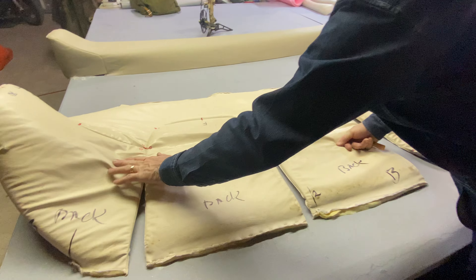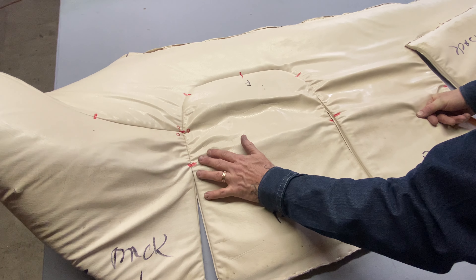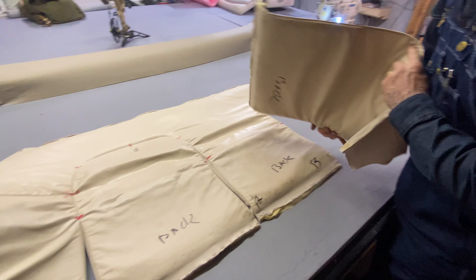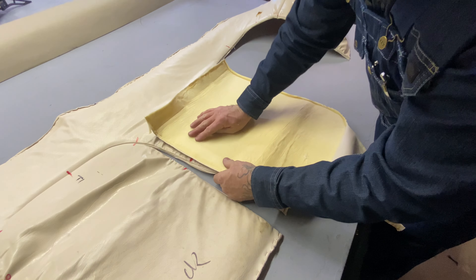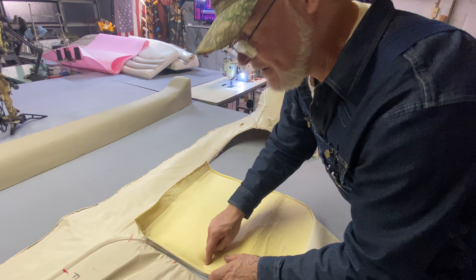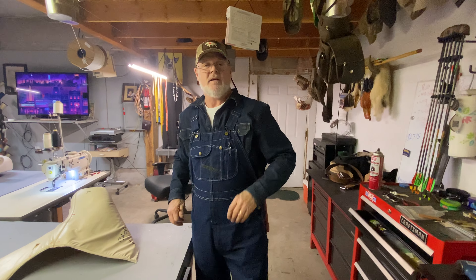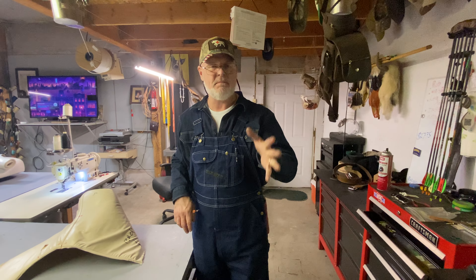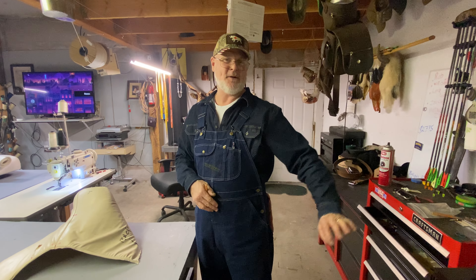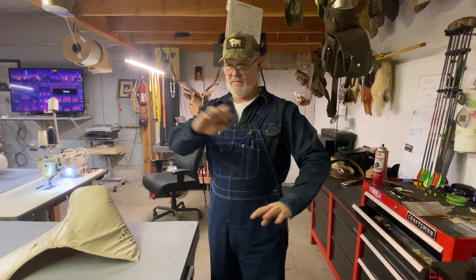You'll see the wrinkles in here — there was gathering here. He pulled it out when he upholstered it, but that shows he was trying too hard, pulling instead of letting the machine do it. He wasn't mindful that when you have two pieces of vinyl together with foam and you're sewing, there could be some gathering. Just go slow — about three inches at a time and stay true. Plant your needle, adjust, plant your needle, adjust. Be precise and consistent and always be mindful of gathering underneath you and what surfaces you're using. You don't want to destroy what you just did just to finish what you're doing right now. You've got to look behind you all the time, beside you, in front of you.